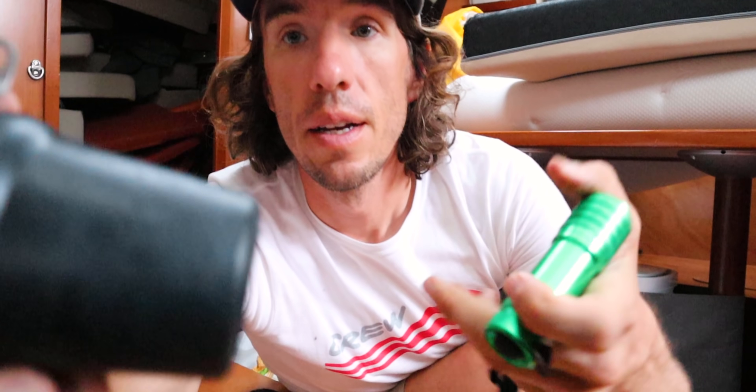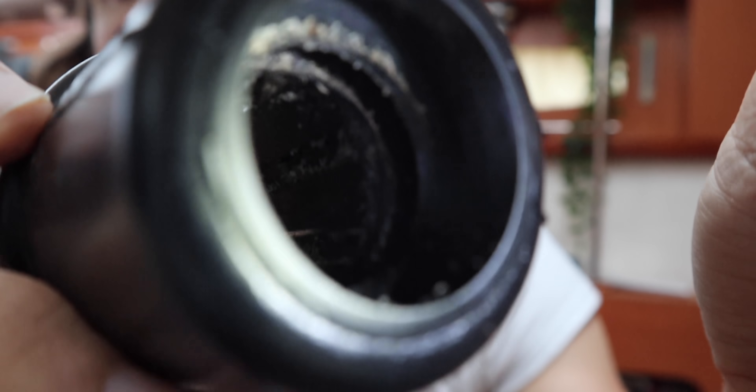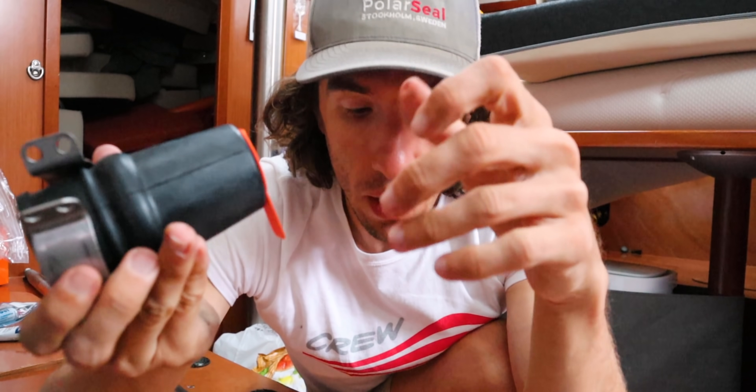This is the shaft. Do you think this is the reason why it was stuck? Ryan explains the Volvo shaft seal: it has two functions — inside are seals which keep water out as the shaft passes through, and there's also a bearing piece with grooved lines. We need to insert a little rubber protector first to protect the seals when placing the shaft in, since the seal is really sensitive to any burrs that could damage it and let water in.